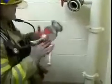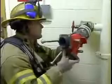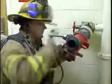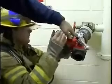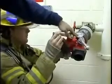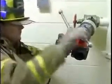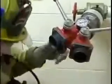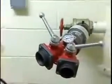We're then going to hook the most important part of our standpipe pack, and that's the inline gauge. It is paramount that we have an inline gauge in place off the standpipe. This is our discharge valve on our fire truck. All we've done is taken the fire truck and moved it 20 floors up, and we've got our discharge gauge. It's paramount. We get that in place, and we're good to go. We're ready to hook up our hose.